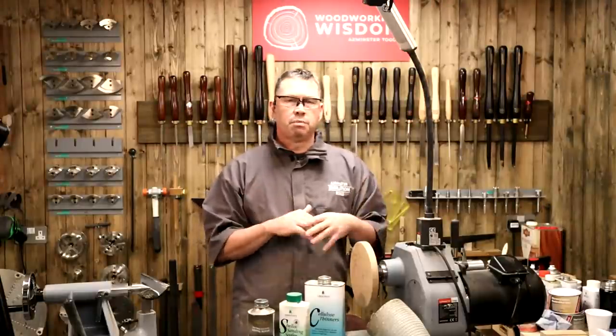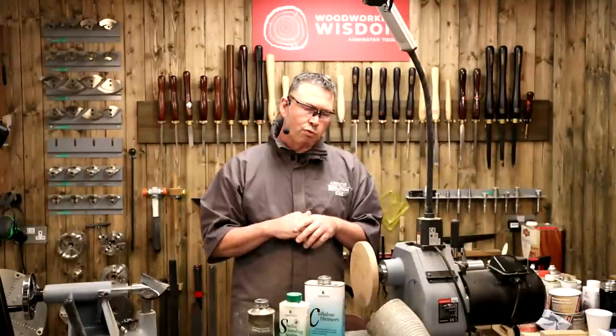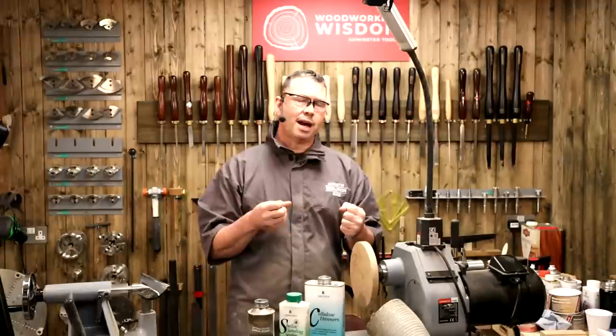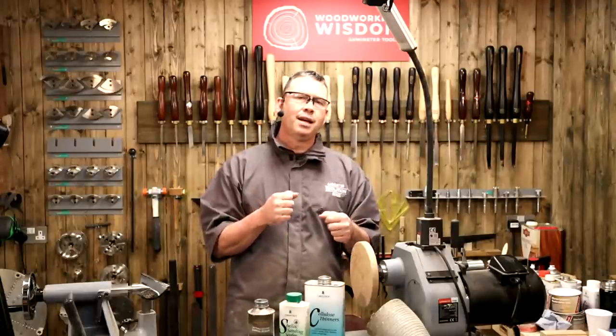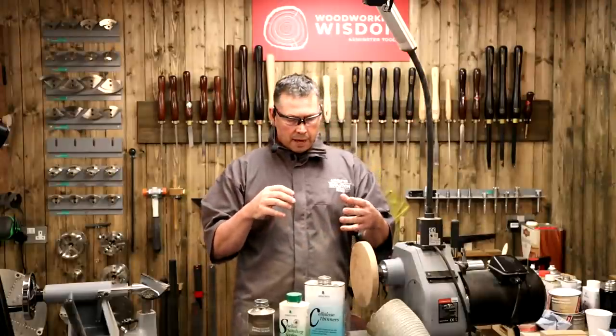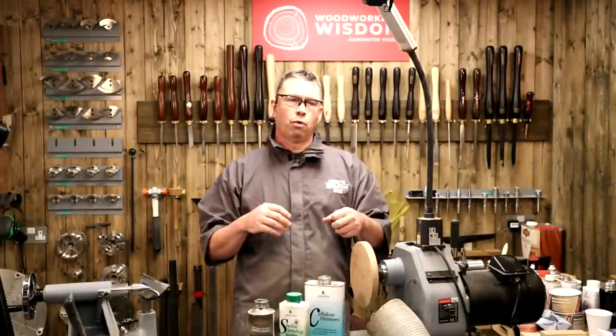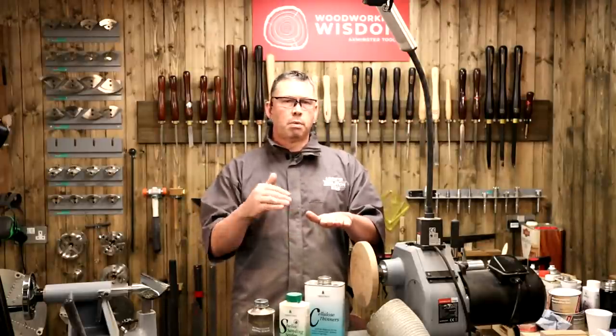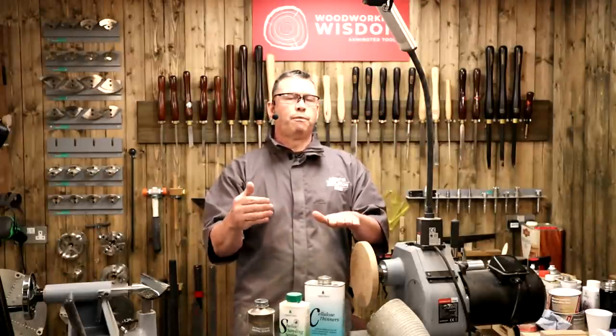Between about 30% and 50% thinners. That makes it really, really liquid. It soaks in a long way, penetrates the grain, but it dries so quickly, literally within about 20 or 30 seconds, you're ready to go. And if you've never used sanding sealer before, it's designed to penetrate in to lock the grain in position. So remember what we were saying about what finish we apply afterwards.